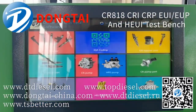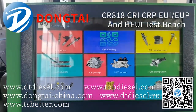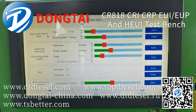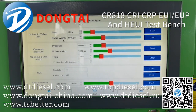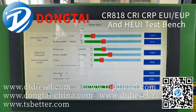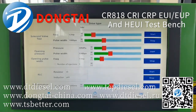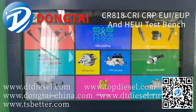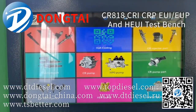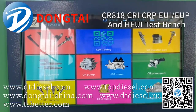This CR818 test bench can test common rail injector, common rail injector part. It can test solenoid valve for frequency and pulse width, for the pressure, frequency, resistance, and inductance. Also can test AHE armature stroke. EUI, EUP, common rail pump, HP0 pump, common rail pump part, and HEUI.